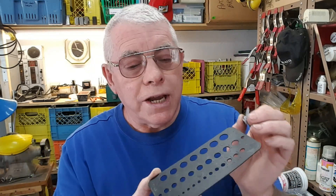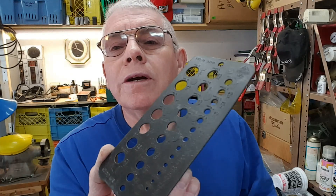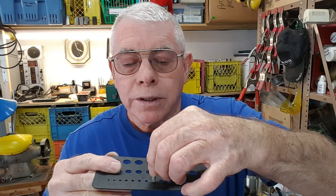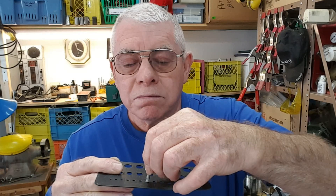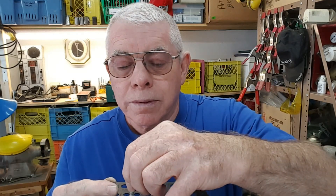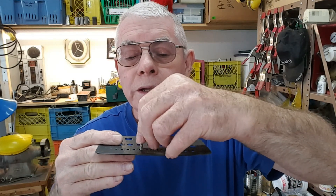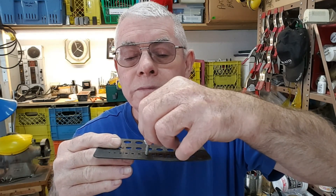You take your screw and follow along, progressively going down the holes. That one's snug, that one's a little snugger, that one's too tight, this one could be okay, this one's not too loose. We've determined it's a 9/64 drill, and that should allow this to self-tap in without snapping off — at least we hope.